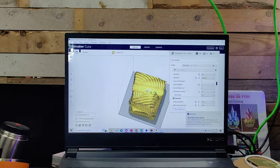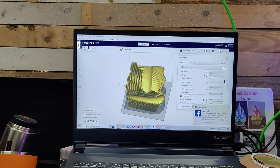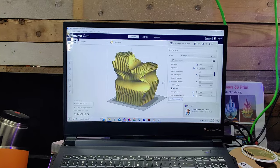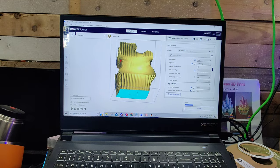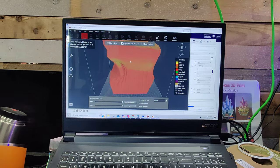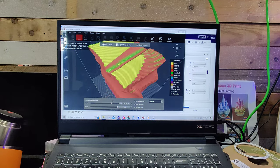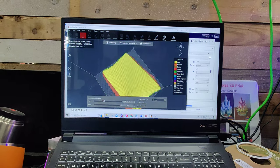When you start getting into production and large prints, this is a 1,200 millimeter print — almost exactly four feet. Cura has been having a hard time trying to slice this and has failed multiple times. I did get IdeaMaker to slice it, so it showed me its version. But IdeaMaker doesn't have lightning infill, and that's what I want to use.